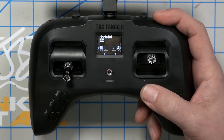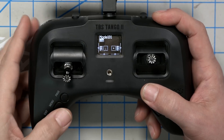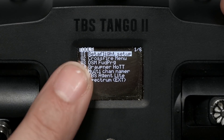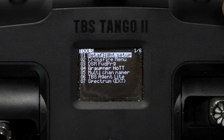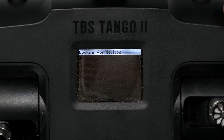Let me show you what this looks like on a different radio. This is the TBS Tango 2, and you can see that, like several other radios, it doesn't have a separate SYS button. In this case, long press the Menu button — that brings us up into the Tools menu. So if your radio doesn't have a separate SYS button, long press Menu. You may need to page to the Tools menu, and go down to TBS Agent Lite. It's the exact same app, but it doesn't have quite the fancy graphical interface. Even if you don't have a radio with a fancy graphical interface, this is still well worth doing.